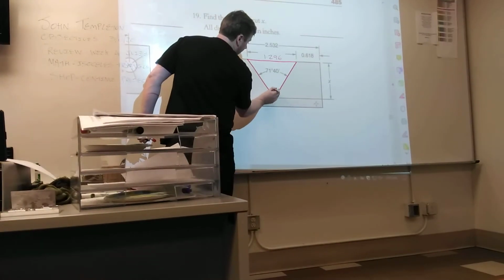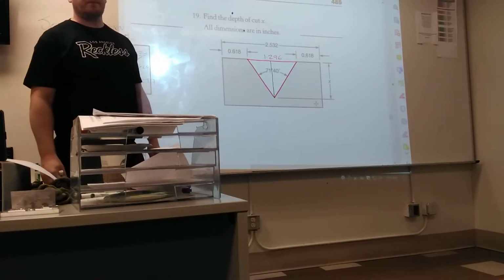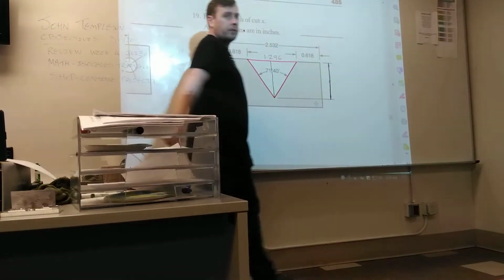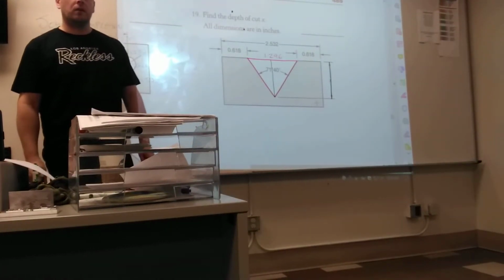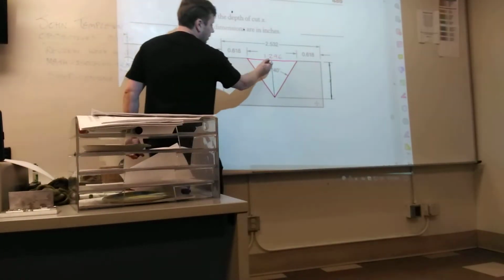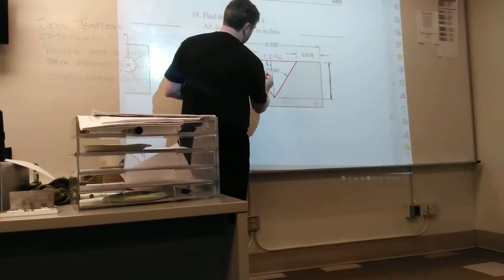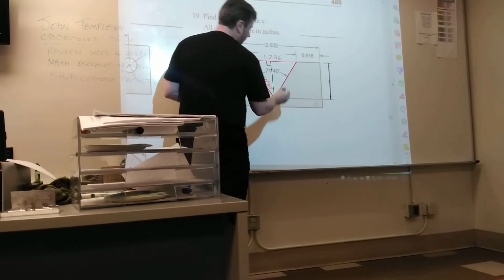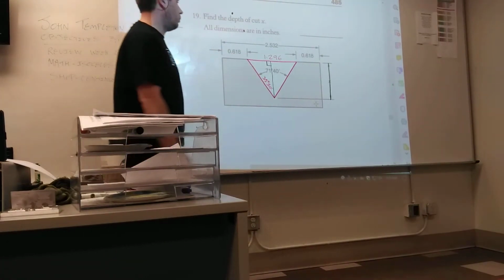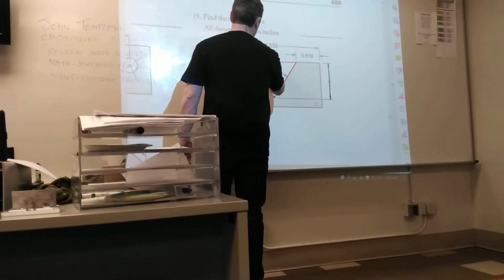So what do we know about this line? We're gonna split it into two. What else do you know about it? Parallel. They're both the same line. So that is figured out, you've got X. So what happened to your angle? You cut it in half. So you've got 35 degrees, 50 minutes. What happened to your base? Cut in half. So what is 1.296 divided by 2? 0.648.